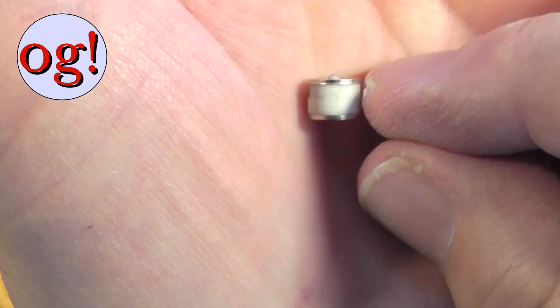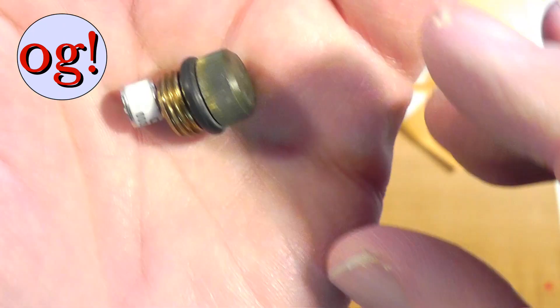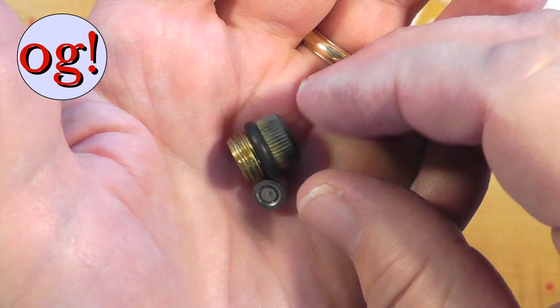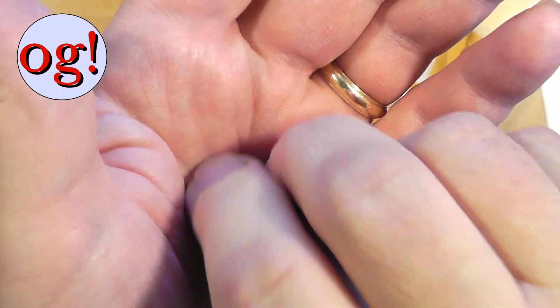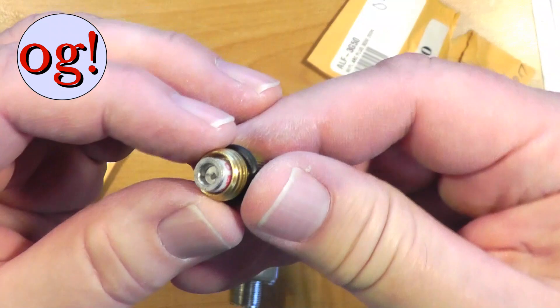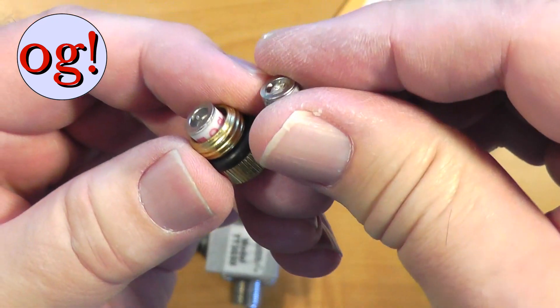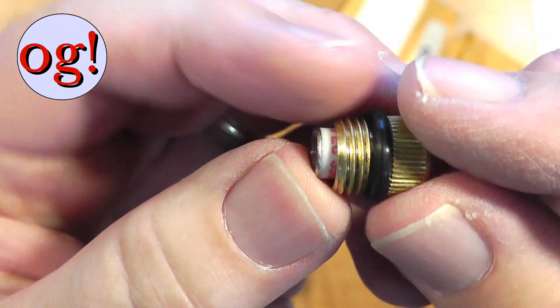This is the glass — actually ceramic — capsule. The one for the higher voltage and the one for the lower voltage. By the way, this one came out loose, and it looks to me like it got zapped by a nearby lightning strike, which can induce quite a bit of voltage in an antenna and caused it to come apart. The one with the red lettering is the lower voltage; the one with the gray lettering is the higher voltage. We're using this with 200 watts out of the antenna.